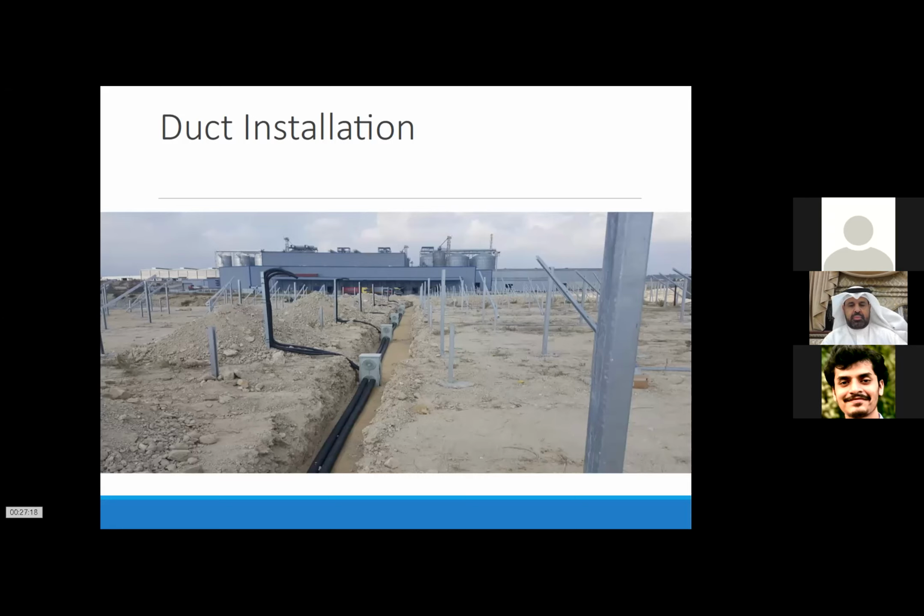Most of the time when I do troubleshooting, the first thing I do is activate this function and check the earthing. What I'm checking is the possibility of wrongly dimensioned wiring, or some problems from the facility. Maybe you have an industrial complex, or maybe you go in hybrid mode with a diesel genset. When you do that, you can see the problematic issue with the cabling. Most of the time people think electric, but PV is a little bit different. If you produce on site, it has a different effect than if you consume on site. Also some industrial complexes in Pakistan, in India, and some in Europe, when they use this mode, they had troubles